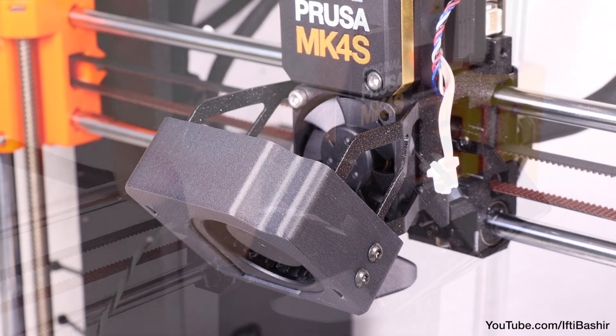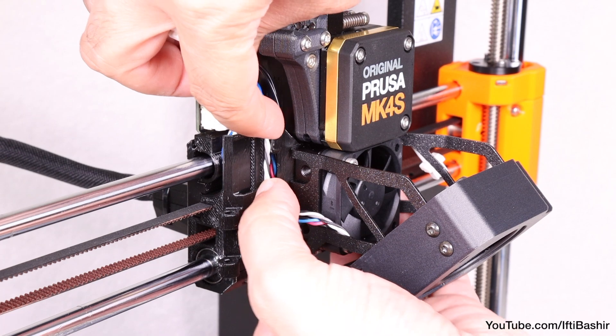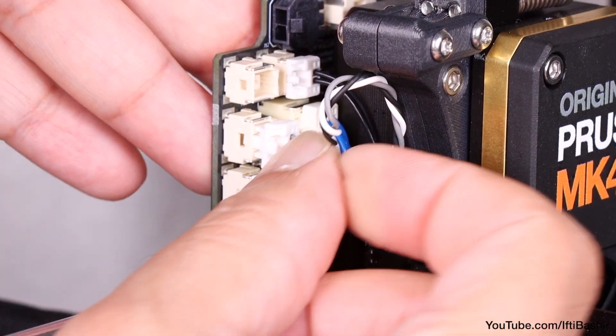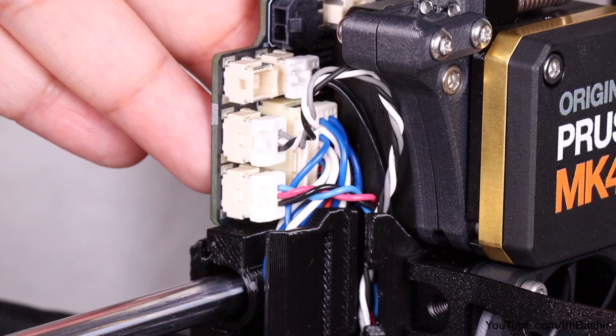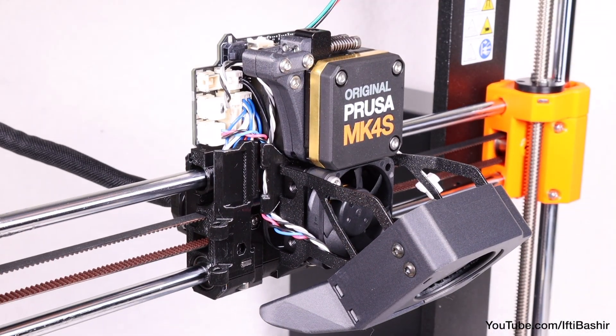In the orientation shown — with the fan held diagonally and open end facing downwards — guide the fan cable through the cutout on the left side of the fan holder, then slide the two forks of the fan holder into the pockets on the sides of the fan blower assembly. Secure with two M3 by 5 screws on the left side and two more on the right, then guide the fan cable through the cable channel in the X carriage and up to the middle connector on the side of the LoveBoard.